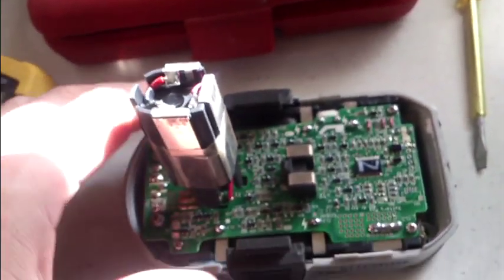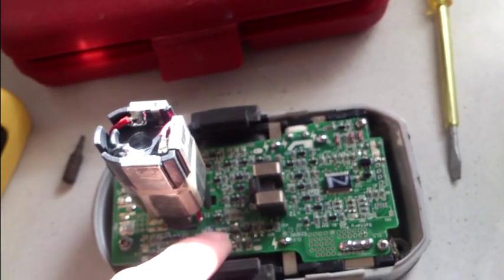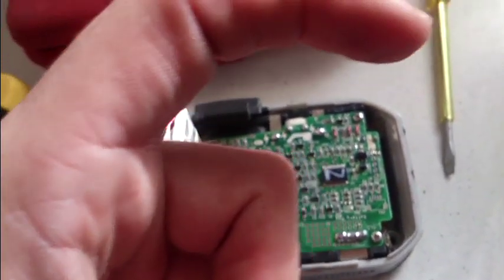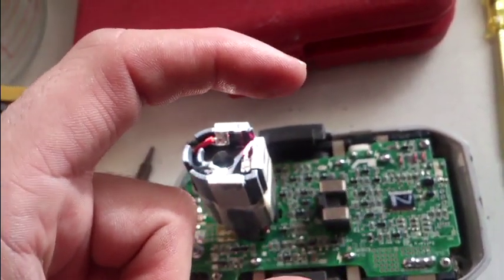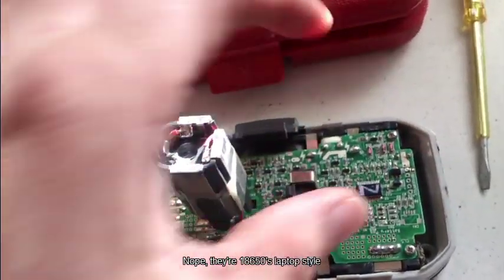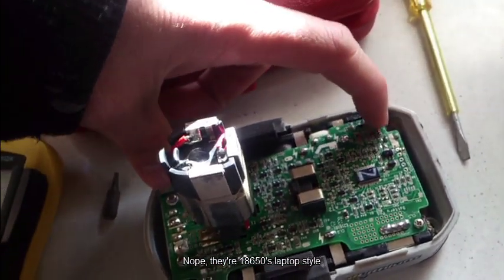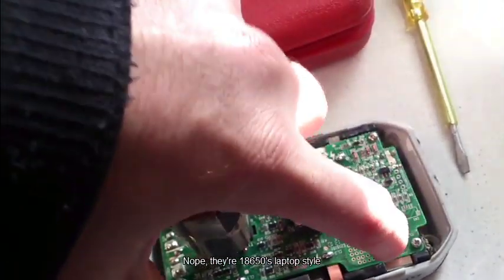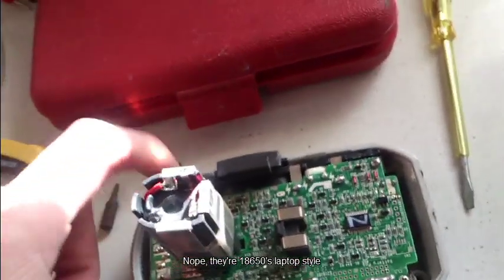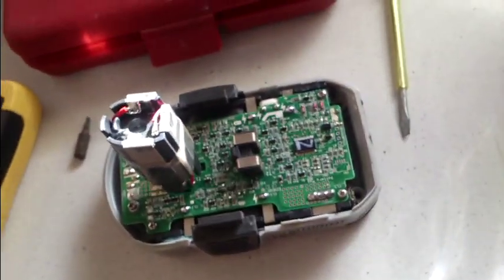What I'm interested to know is this, I think they're lithium-ion. They'd be a smaller battery than the big ones. They're using the 4 amps, obviously. Your laptop-sized batteries, or the ones in most laptops, are about yay long, and then they just stack them in like that. These must be a shorter one, and they must be like that. Now it's 18 volt, 3.7 volts a cell, or 3.6 volts a cell, roughly 5 cells or thereabouts.